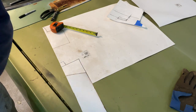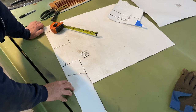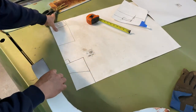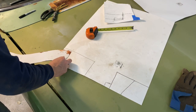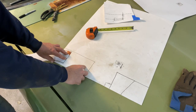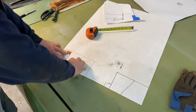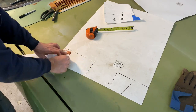So I wish I could just like magic wand clone that and have it work. But we'll tip the top edge again like we did last time. And the only thing I need to do is, like I said, add on up here so that I have room for overlap with the other piece of frame that I've already made, and that is not really in the car but is just sitting in place right now, so that we have a good overlap to weld those two together, so we have a good strong piece there, so it's not weak where we only have a little teeny bit of overlap.